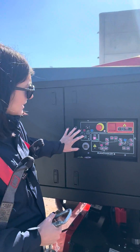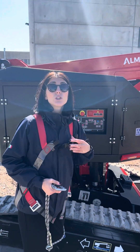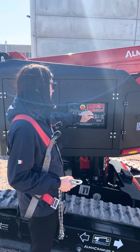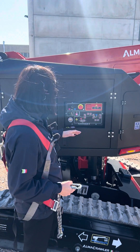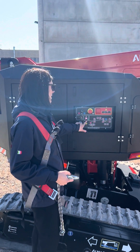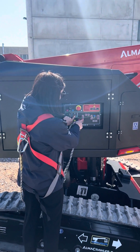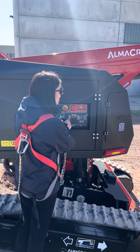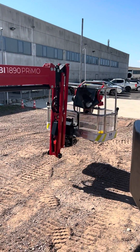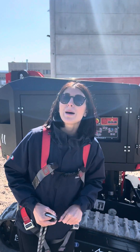As you can see, ground control is pretty easy. This is a full electric machine, so when we turn it on you're not going to hear anything. The emergency stop button has already been released and we've put it on ground controls — the pink ones. The on button is flashing; when I press and hold it, then hold the down button, it will lower the boom. The on button functions as consent.